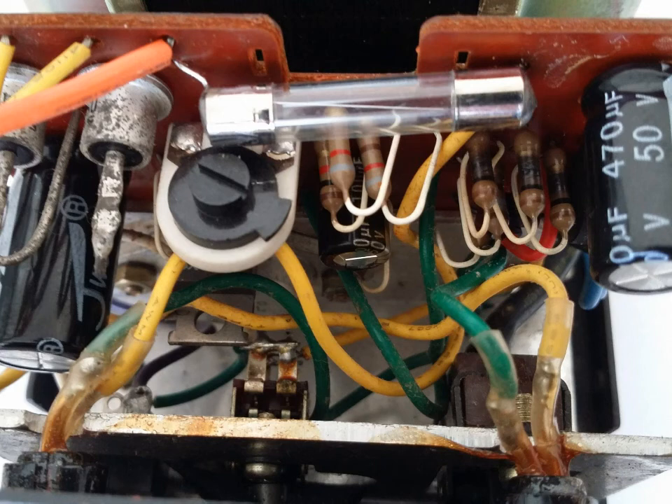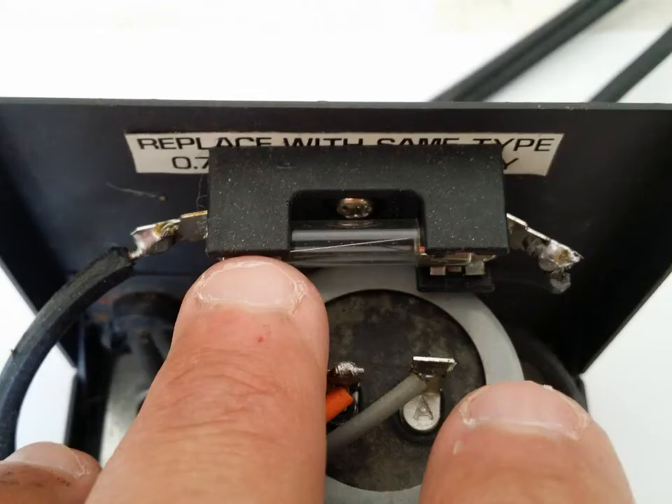You need to service the power supply for the VTC7100 — it is vital. The capacitors are all dried out, just like the capacitors on the machine itself. I've never seen so many dried-out capacitors in my life. This unit is very old, and the capacitors were poor quality even at the time — big and bulky, and they dried out. When capacitors are dried out, electrons can't flow smoothly, and you'll create shorts in the board or power supply. So when you service a Sanyo VTC7100, replace all the capacitors. In my case, it's been replacing virtually every part — transistors, you name it.